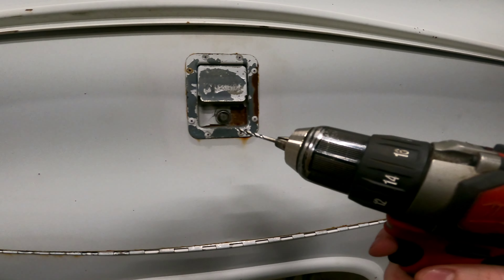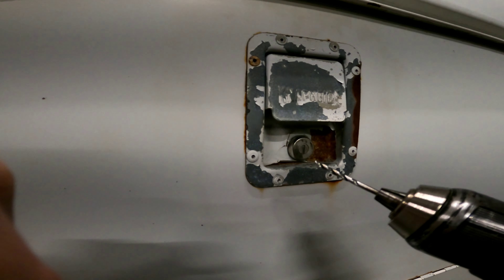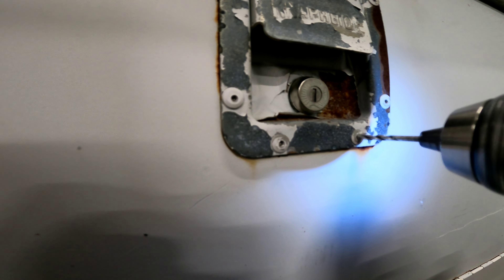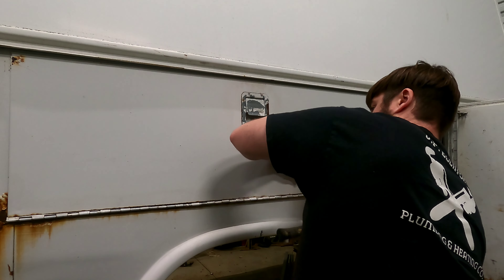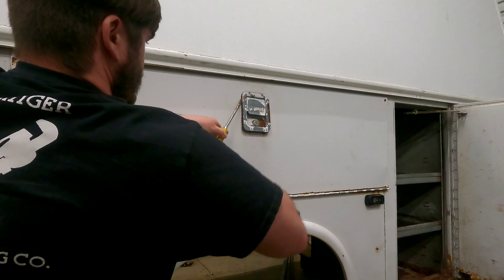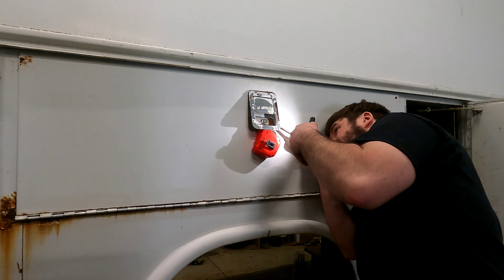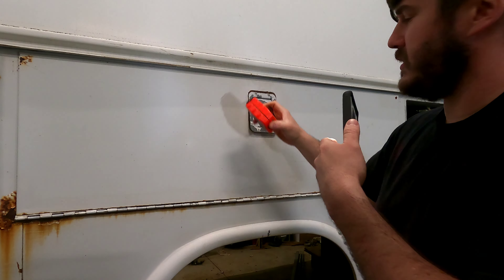There were one, two, three bins that were locked. Here's the universal key to open these locks — drill out these rivets. Next you get your hammer. Then you pop the little clip lock part out, and that holds the handle from turning.